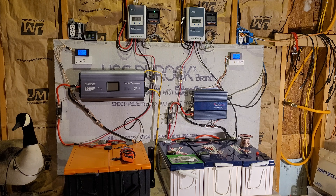That doesn't happen very often. It also means that once the system is charged and you know you're going to have good weather, you can draw the system down to about 70% — playing with the electricity, running the refrigerator off-grid — and still feel pretty safe for a week. This time of year it's possible to go 8 to 13 days without sun, but in the spring and fall that rarely happens. That means with this much battery power you can play with the electricity for eight months out of the year.